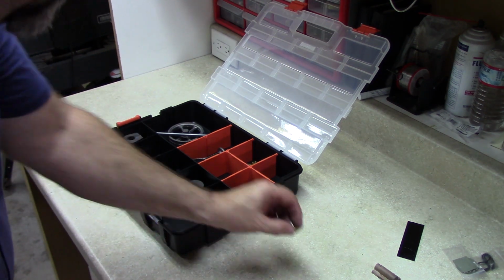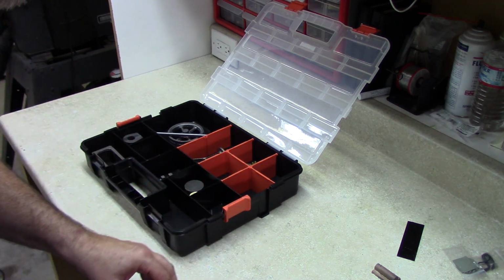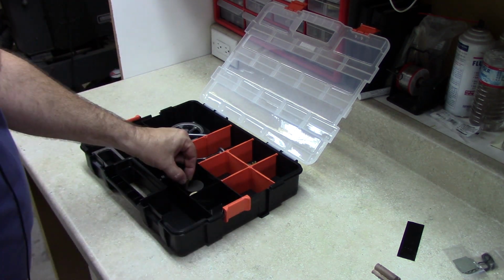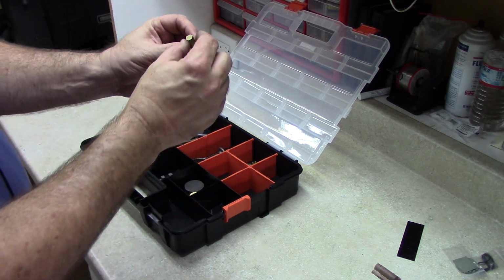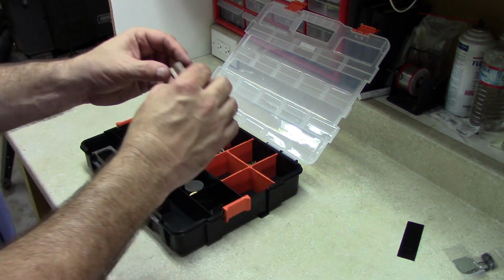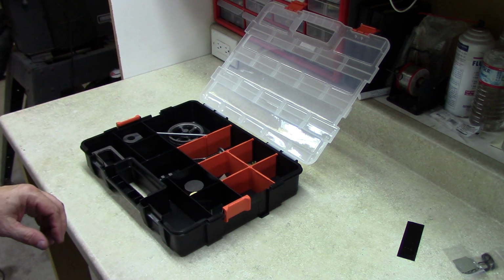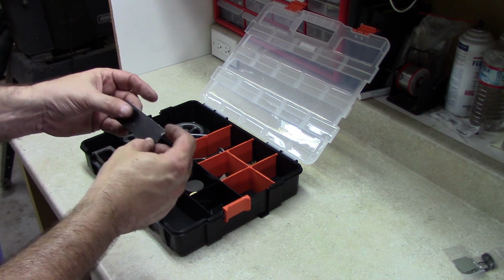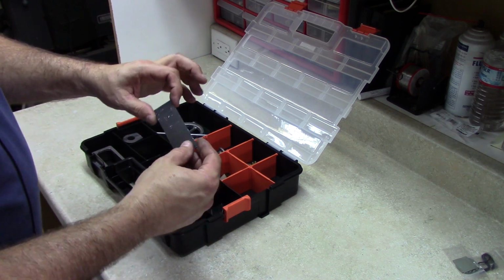The valve operating block is just a small little piece of brass they've provided here. The fork end is a piece of 1/4 inch square brass. The valve rod gland is, they're calling this 2BA hex. I'm assuming this hex fits a 2BA wrench. So we've got that. And we have the crankshaft bearings, which are a casting that we had seen earlier. So we've got those. The cylinder lagging is this piece of aluminum. I'm not really happy with the quality of that. It got kind of dinged up. Anodizing isn't that great. I may end up remaking that myself.